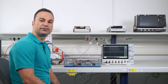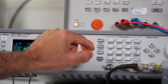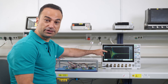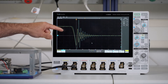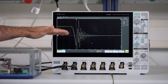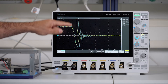Now we measure the so-called reverse recovery behavior of a 100V 3A Trench Schottky from Nexperia and compare it to a state-of-the-art product from a competitor with the same electrical spec in a comparable package. On the scope you see the currents through the two diodes, going from the ON state into the blocking state with the mentioned 1A per nanosecond ramp. The area below the horizontal line corresponds to the stored charge in the device, and this area is obviously smaller for the Nexperia product compared to the competitor product.